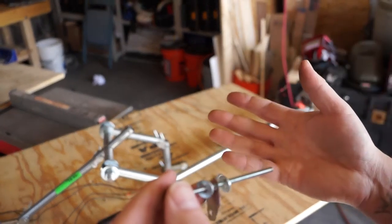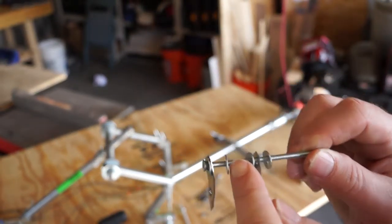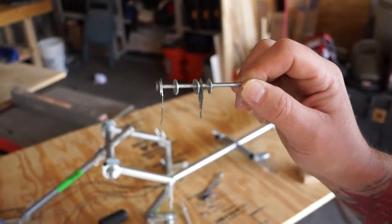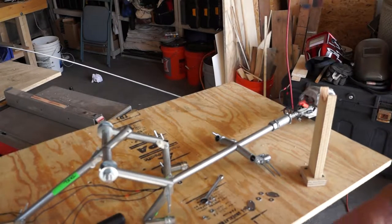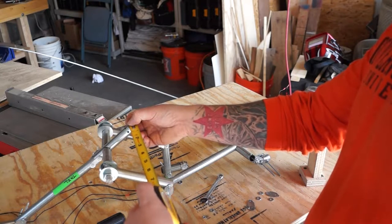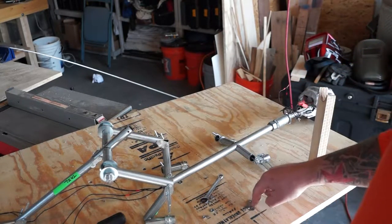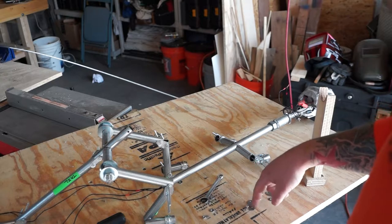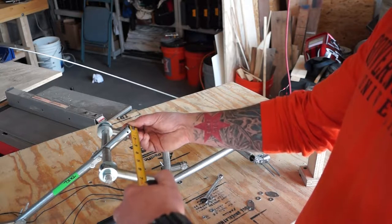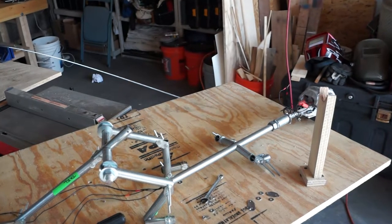So the next thing that I think I'm gonna try is increasing the size of the connecting rod. And I think we're gonna go ahead and go up to a 1/4-20 size. Given the fact that all we need to do is go through one spine segment, which is just a hair under 3/4 inch thick, plus the required washers, nuts, and whatnot, I think we're gonna go ahead and make this initial piece of 1/4-20 rod. I'm thinking 1 1/8 inches in length will be plenty.